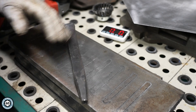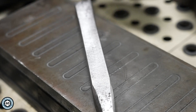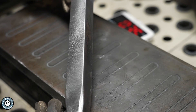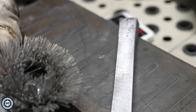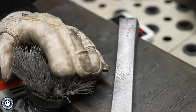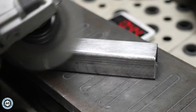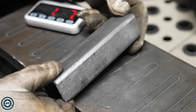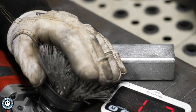For the ornamental metal workers out there, here's a piece of one by one inch solid hot roll bar. In 35 seconds this side is super clean bright metal versus the mill scale side. Getting mill scale off solid bar is tricky. There are just a ton of applications for a diamond wheel, and you can probably guess it works great on tube too — about a minute and the finish almost looks like it was blasted.